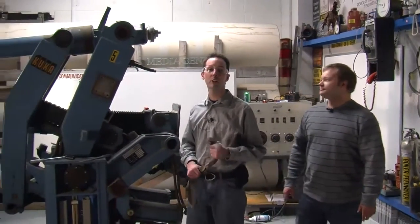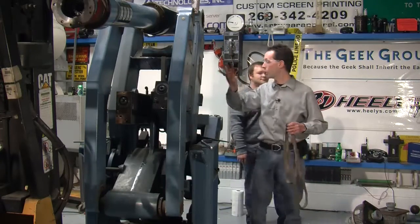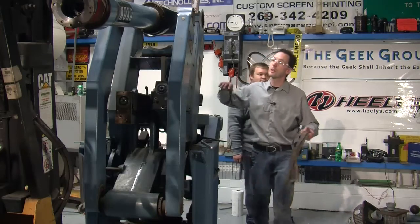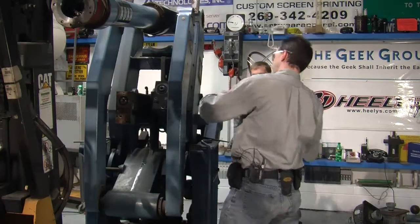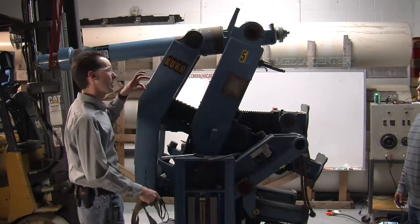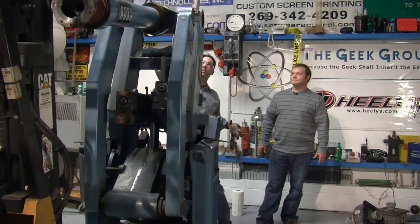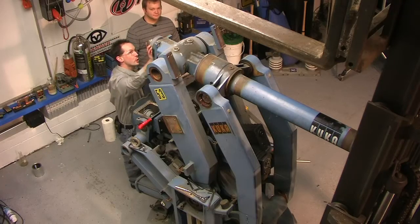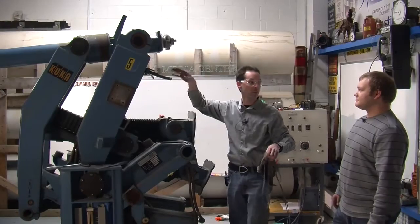Hi there guys. I'm Chris Bowden with the Geek Group, hanging out with Zach Briggs, a Geek Group member. We're continuing our equipment autopsy series on decommissioning project Kevin — this video we're going to take the big arm off. Down the middle of this arm are concentric shafts because there were originally three motors back here that move axis four, five, and six — three big motors in a triangle moving these pulleys. We took all but this last pulley off and we don't know the arrangement inside. Total black box engineering.